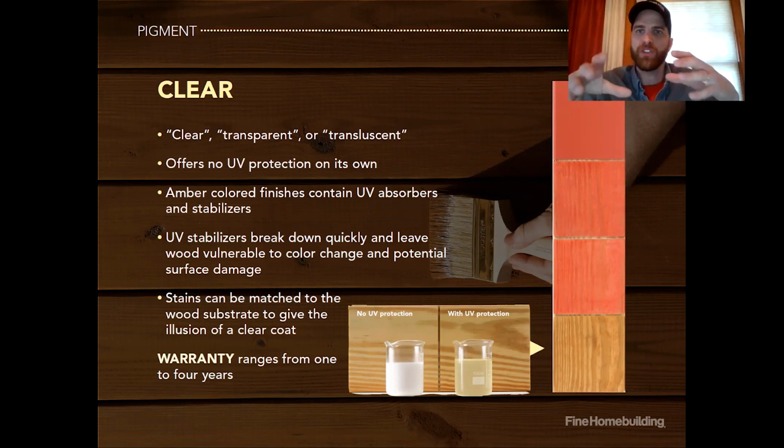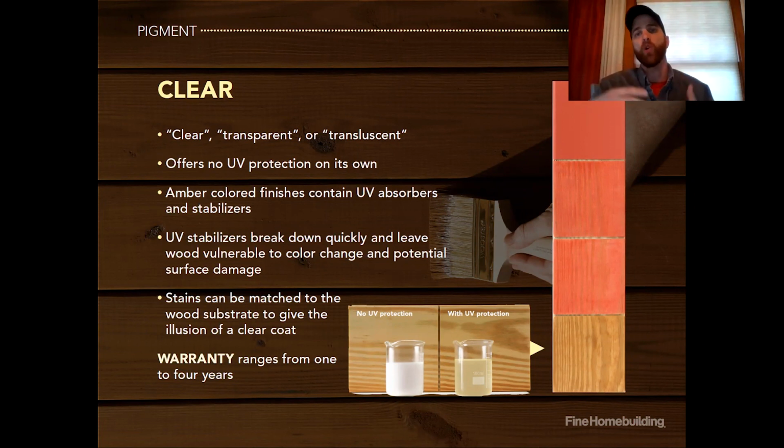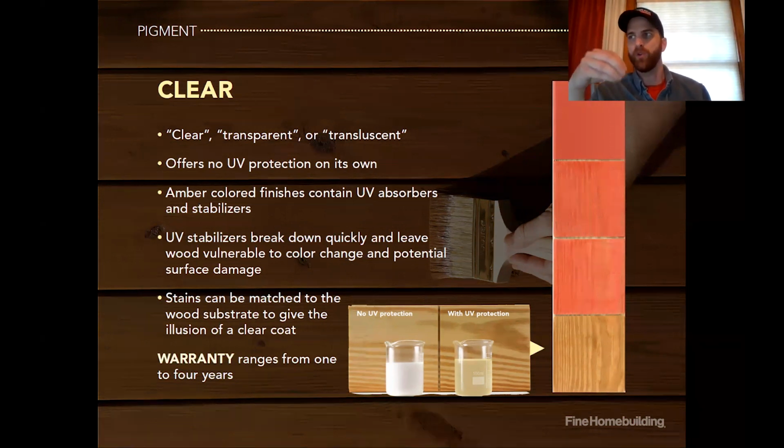What we worry about too with water coming up out of the ground and keeping the underside of your deck relatively wet is that what we want to do is add basically what we refer to as a capillary break. So the way water moves is it moves from big to small. As long as the water is able to absorb into a finer surface, for instance, from gravel to sand, it will continue to move.